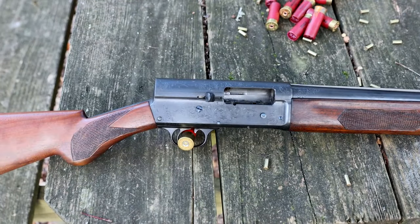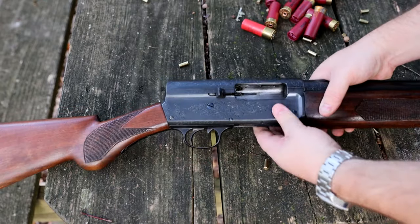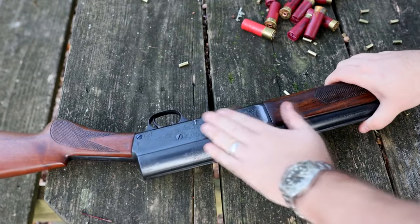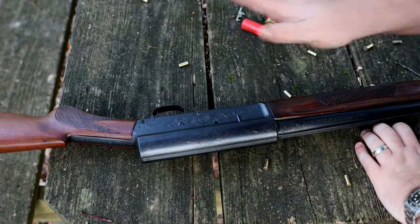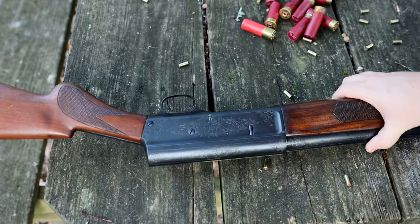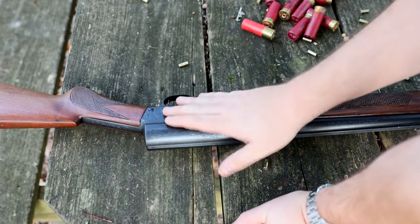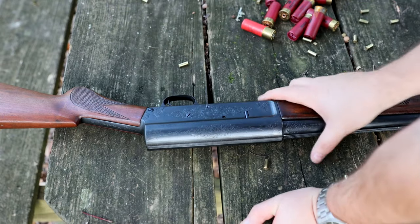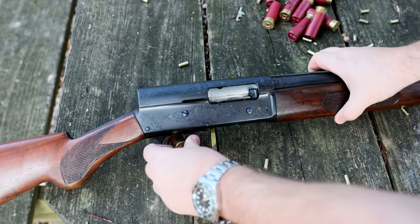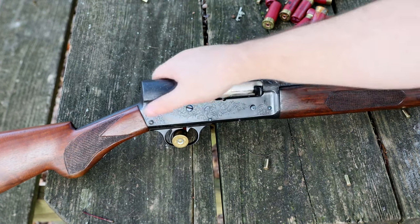You can see the bluing looks beautiful. A good old classic rust blue does a gun great. It looks really, really nice. It turned out a little bit rougher than I'm used to. If you guys go through and do a rust blue on your gun and you choose to steam it, wash the parts off before you're done, once you finish the whole process. I had a little bit of trouble with after rusting, which from what I read is actually pretty common for rust bluing if you steam your parts. But as you can see, it still looks really, really good.